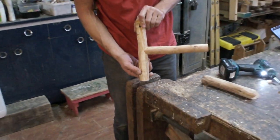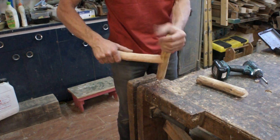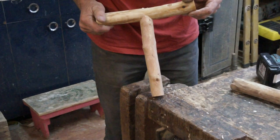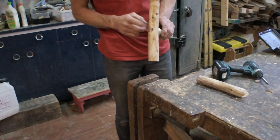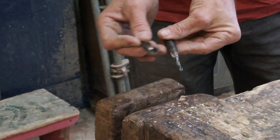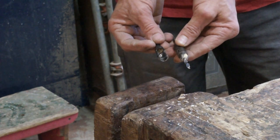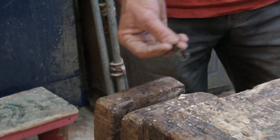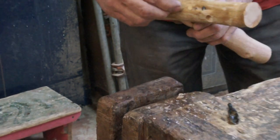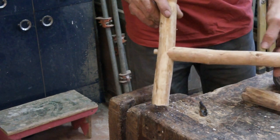There's a small indentation from the five mil so I know I'm in the right place. Here's my five mil screw — this one's 80 millimeters long and I'm just going to put a bit of wax on it, so if I need to open it afterwards I'm not going to snap the screw inside. Pop that through there. That's a nice strong and very clean joint for a stick joint, and you don't have any of the shoulders that people don't always like with the mortise and tenon joint. I have a plug cutter which comes as a set — these make a twelve point seven millimeter plug. You could always drill a twelve millimeter hole and use a twelve millimeter dowel to hide the screw, but I use this plug cutter. It cuts little plugs which we can just pop in here. Put some glue, knock it in, sand it off, and we have a beautiful joint.